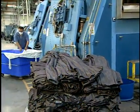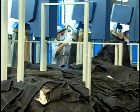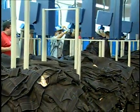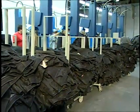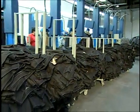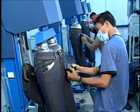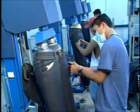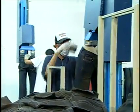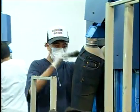Next, let's take a quick look at how denim garments are wet processed through rotary washing machines. Before wet processing can begin, denim garments must first be organized into processing lots. One lot may consist of garments that have come directly from cut and sew, while another may have already received some type of preparatory process, such as sanding or potassium permanganate treatment. Yet another might require additional processing following the wet process.